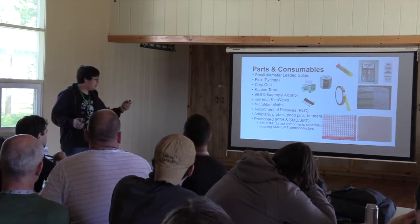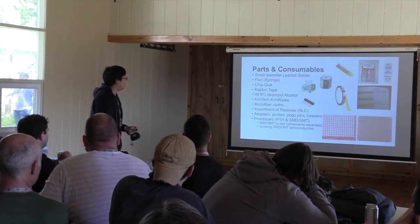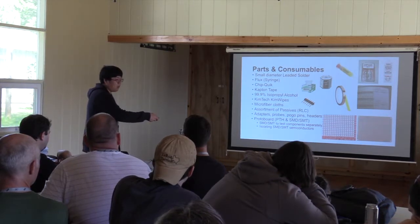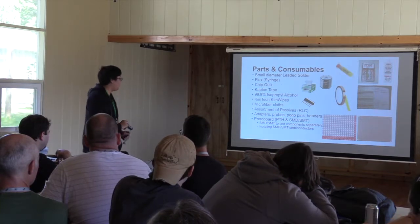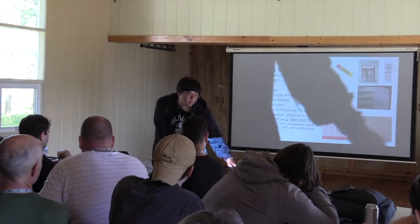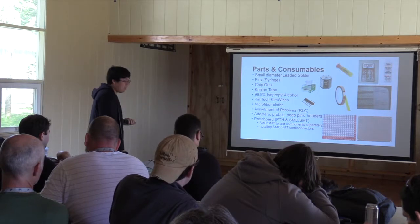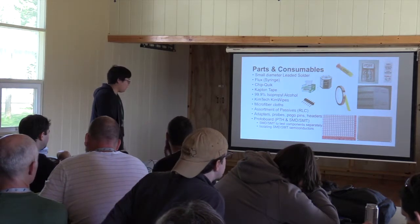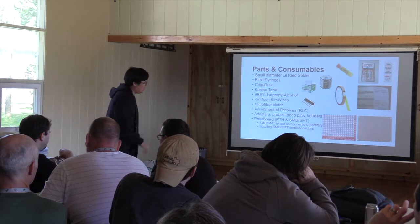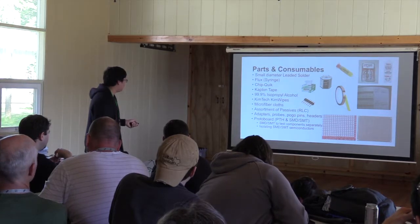And then, as I said with the component analyzers, what I typically like to do is, if I run into those bizarre SOT-363 packages, I think that's what they are, the 6-pin ones with two transistors, I typically just isolate them on this kind of surface mount probe board, and then use this to identify it. Is that a logic probe? Oh no, this is a semiconductor analyzer, so it'll tell you what kind of transistor device, or a diode or an LED. And it'll even give you the pinout, because a lot of those will have a pinout that's mixed completely from the diagram, so it's nice to have that.